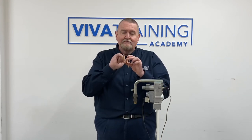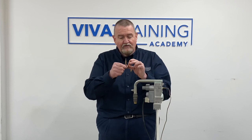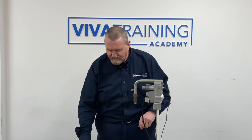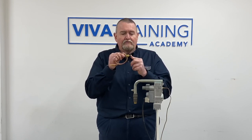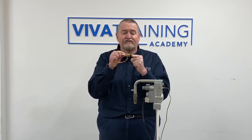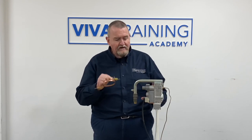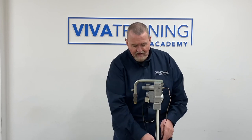It's basically two dissimilar metals. At the tip you've got a fine wire, usually made out of platinum or titanium, and then you've got the copper sleeve. As that's warmed up it creates a small electrical voltage — sufficient to power the magnet. It's an electromagnet; when we put power to it, it becomes a magnet. So when we've pushed the button in and held it for maybe 25-30 seconds, providing the thermocouple and pilot are good, it will hold open. When the solenoid is energised due to demand, it opens and allows gas through to the burners, which then cross-light off the pilot.